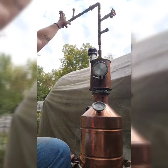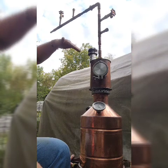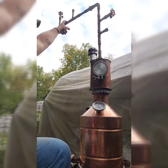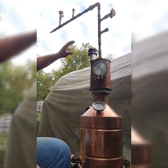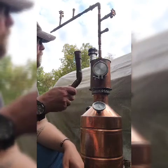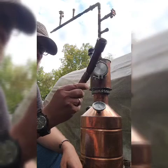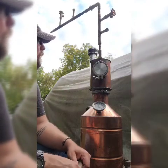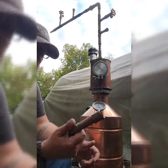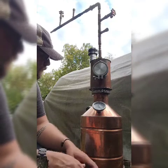We're probably going to have to put just a little bit of a downward arc on this when we run it in a 90, but I don't see that being a big deal at all. In all honesty, it's something we can change. And I'll probably, honestly, for my use and what's on the channel, it'll almost always be 45 because we're not going to real high proofs. We just want a little reflux, etc., and we want to leave some flavor behind.